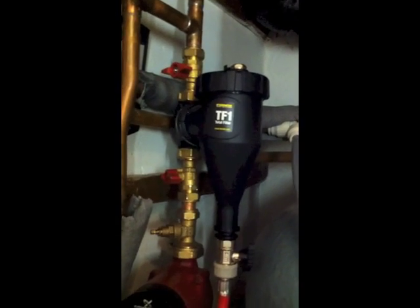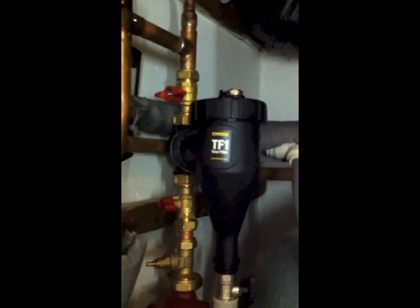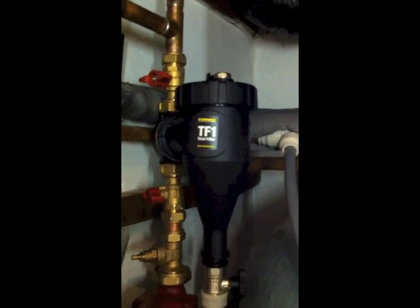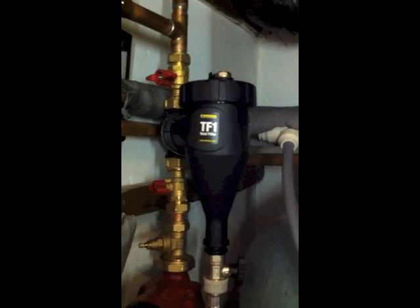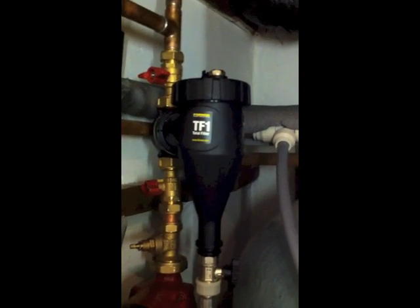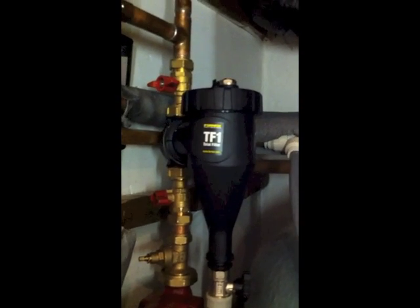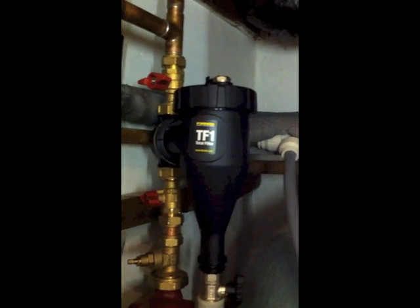That one-handed in a couple of minutes is how to clean a magnetic filter, and it certainly shows how effective these things are. If there's ever any question about whether they remove contaminants, they certainly do. If you have a modern high-efficiency boiler with very sensitive electronics and sensors in the waterways, they will be badly affected by this sludge. There are very narrow waterways in parts of the boiler that this sludge will most definitely affect and damage. These filters, whatever make, will protect your investment in your expensive new high-efficiency boiler and are pretty much a must on every installation.